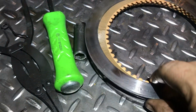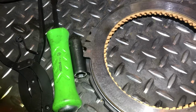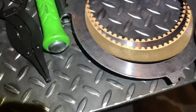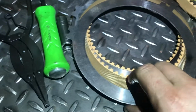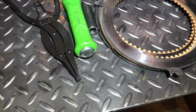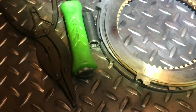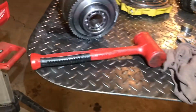On one hand, I guess that's kind of surprising. Well, maybe this was one of the old steels. Yeah, I added the one. But actually, that is kind of cool to pull it apart again so soon because you can see the high spot there, the high spot there, and then right there. But anyways, so that's the forward clutch pack there, and then that other steel must have been one of the older ones. But yeah, I got the reverser pulled apart to this point anyways.